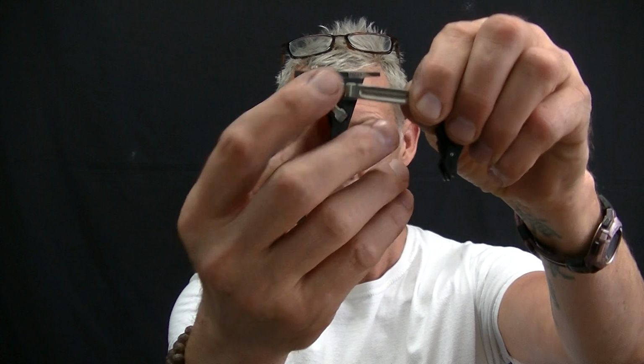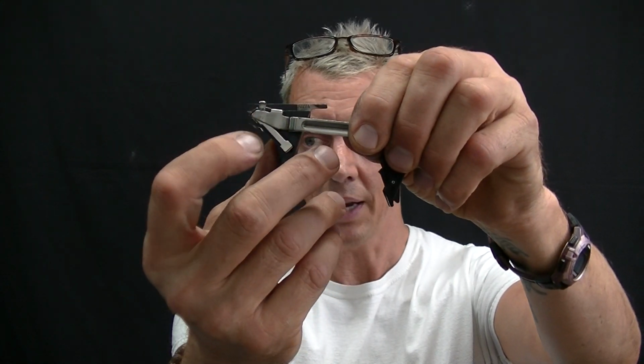And it presents itself just like the connector drag that you feel in the back of the gun, where the transfer bar and this part right here sandwiches against the outside of the gun. But diagnostically, I'll go for the striker first whenever I feel that. But any metal to metal parts are suspect.